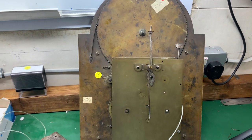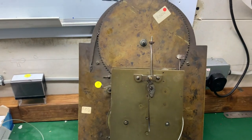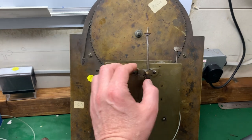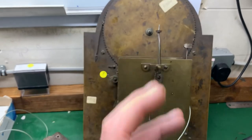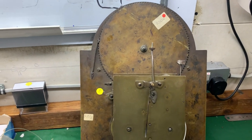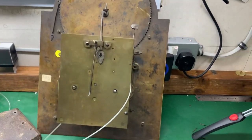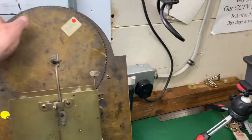We actually look at that underneath our microscope just to make sure. Obviously there are other ways you can do it, you can raise and adjust the back cock, but this has got no pins or grooves, or the holes haven't been elongated to do that. So we're going to leave it like that. We're not going to start doing anything like that, we're just going to rebush that. But my main video is going to be more so on the dial,